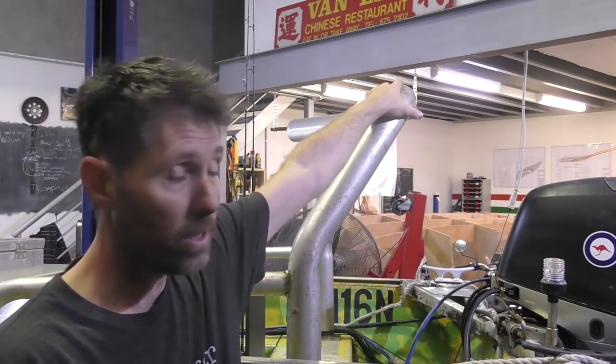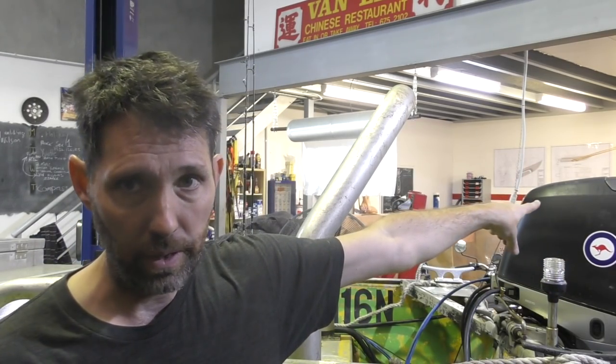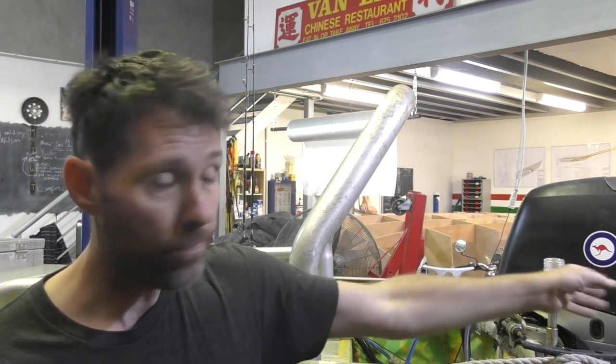So having something inboard that people can grab onto is much safer. Then on top of that, if I'm going to use this bar to have a tow rope going back, I'm going to want some sort of pole or spike coming up to stop that rope going side to side. Then I thought, why not make that pole my stern light as well? Get it off the deck here — this is way too low, and if a boat's coming from the other side it's obscured by the outboard, so it's not even technically legal. Having it right up there would be ideal.